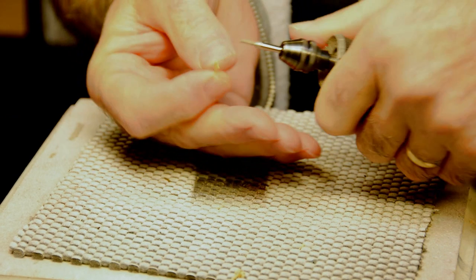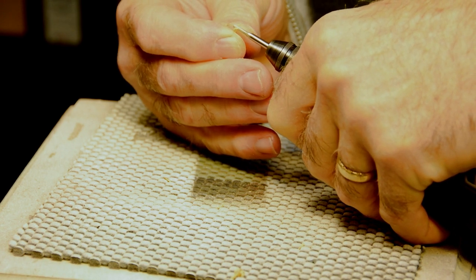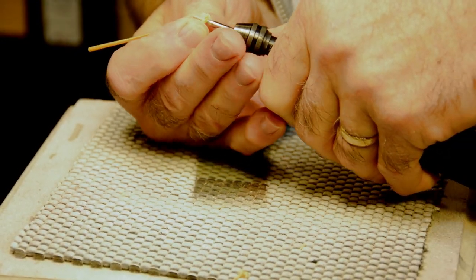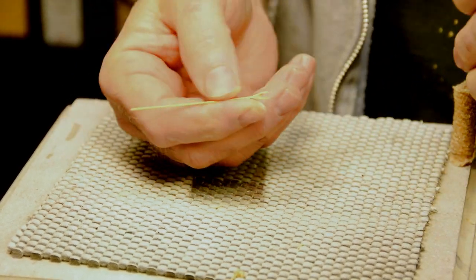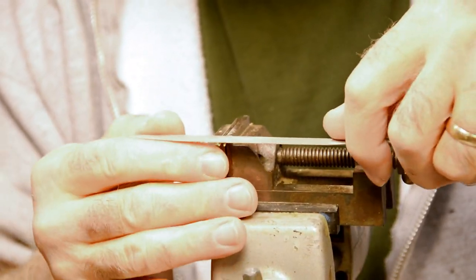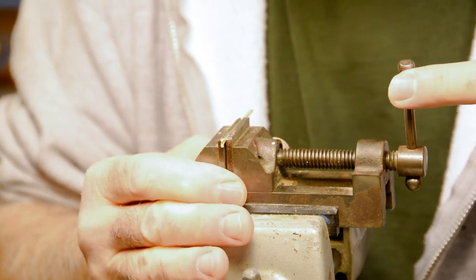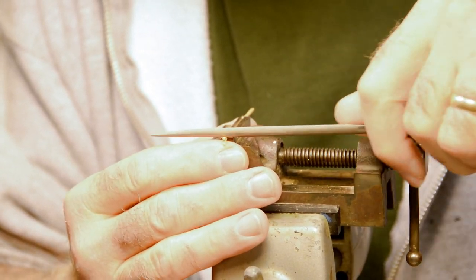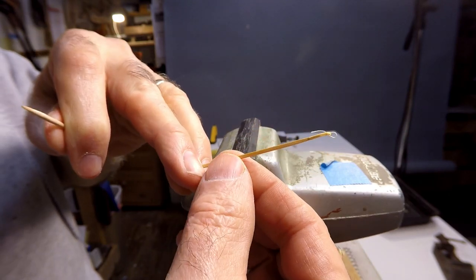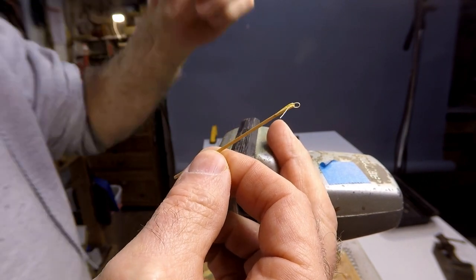The jaws had to be opened up to allow that 84 thousandths thick mast in. Luckily, I had a diamond grinding bit, straight-sided, that was just that size, so it really simplified the process. Once that was done, I was able to get rid of any machining marks left by the grinding wheels with a little bit of hand filing. Off camera, I completed the work on the jaws by drilling six holes: one for the outhaul, two for the peak halyard harness, one for the throat halyard block, and two for the rope bale. You can see the rope bale installed on the finished gaff jaws right there.